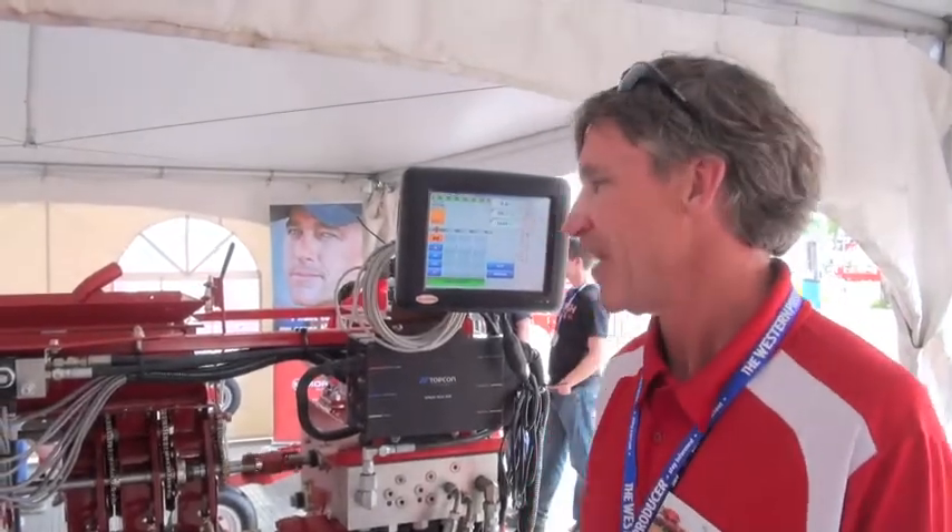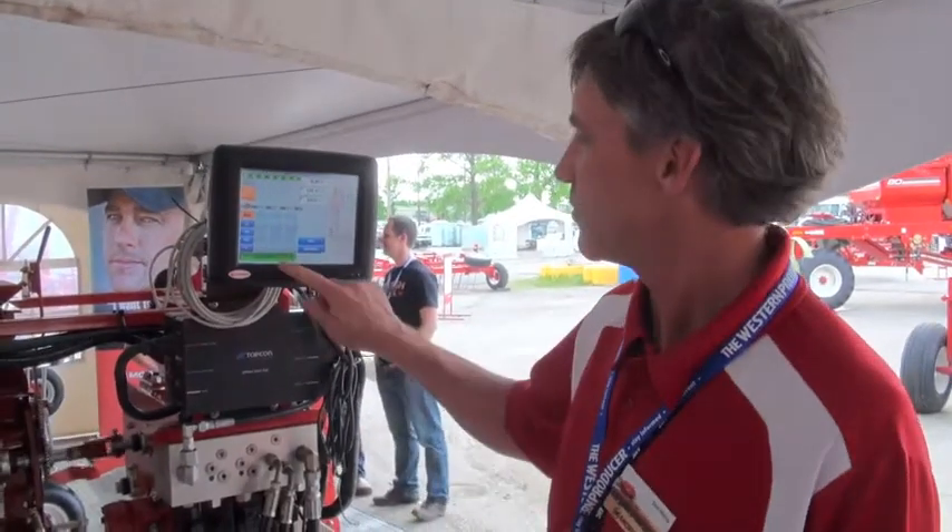We're using small hydraulic cylinders — only an inch in diameter — so very little hydraulic flow is required to engage and disengage. It's just a real effective, simple system. Are most farmers seeing the value right away in these kinds of systems? I think they are. One fellow from Alberta in the booth today said in five years you won't sell a tank that doesn't have sectional control. As the price of seed goes up, there's real motivation to not be overseeding. The area that's over-seeded never does as well anyway — you've doubled the fertilizer and the seed, and a canola plant doesn't like to be crowded. Here we are with an expensive seed putting more on where it doesn't need it.